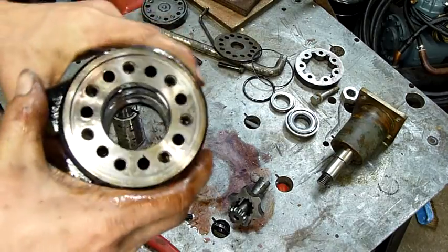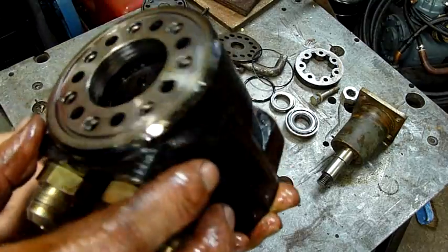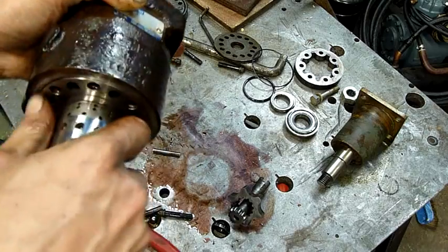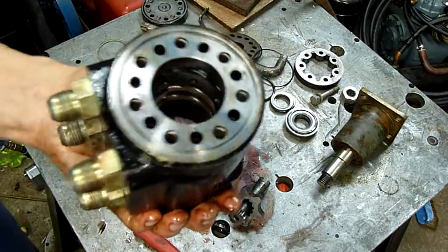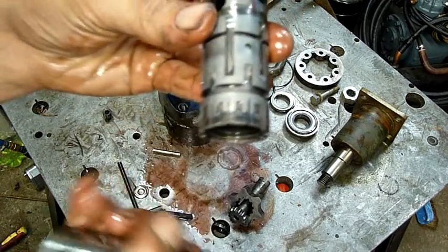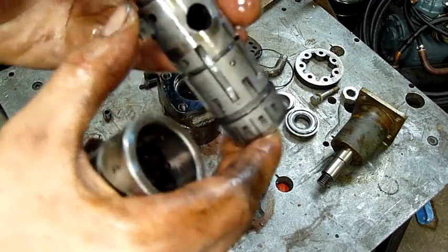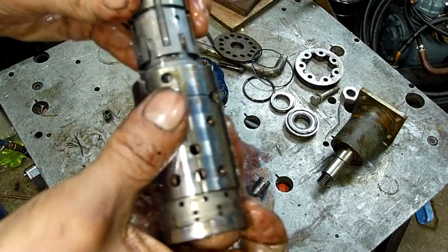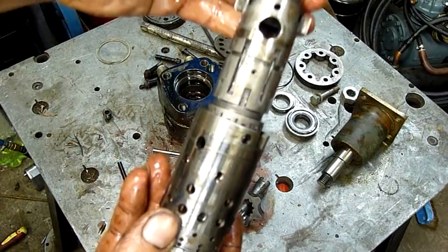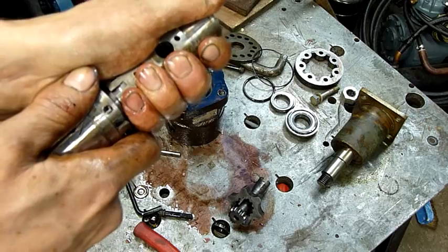It's sort of like diesel injection pumps — everything has to be at a specific temperature or the pistons won't even fit into the bores. There's not a lot else left in this thing. Well, that's about all there really is to it — it's just a rotary proportioning valve. Kind of interesting though, I like this assembly. Amazing detail on the machining and the grinding. And that in there is an internal sleeve actually — it's got a sleeve inside it to spread it out into the outer walls of this outer sleeve. Some real steampunk sci-fi stuff right there.